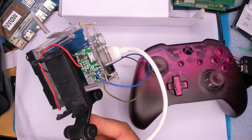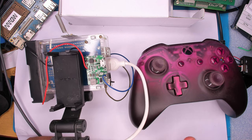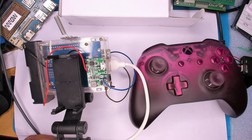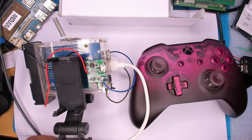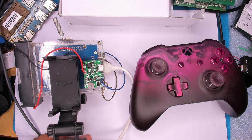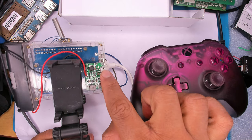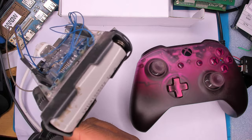On the other side I have a LiPo charger. The Adafruit one is much more mature — it has a proper on/off switch, charging controls, and LED states for charging or discharging. If you have time to buy the Adafruit one, do that. Otherwise, do what I've done: add a switch on the power side. The LiPo connects directly to the Arduino and you can charge it through the mini USB jack. I'm using a single LiPo, a 2600mAh cell taken from a power bank.